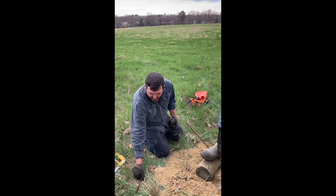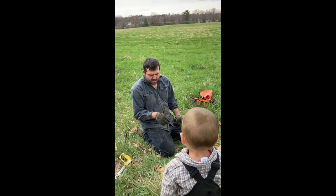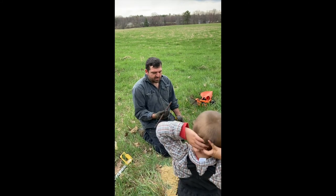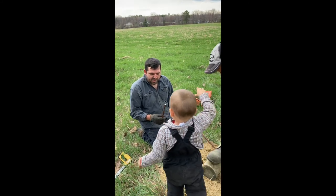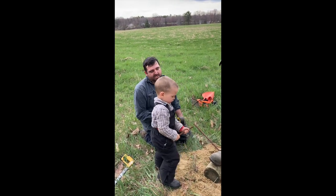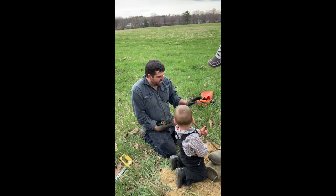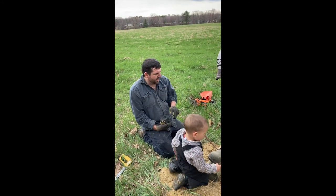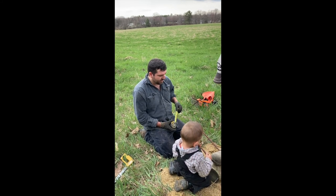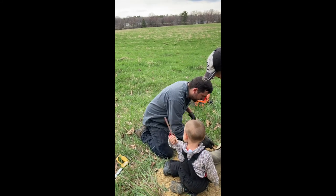So you can buy fancy galvanized pins to put your H-brace assemblies together with, or if you're all cheapo like me, I have some good old half-inch rebar left over from a couple of smith projects. So we are cutting them a foot long, 6 inches into the corner post, 6 inches into the H-brace. Then the one for the side, where the wire is going to be round, I'm going to make it like 14 inches, so I have an inch or two sticking out for the wire to go over. So that's what I'm going to make next.